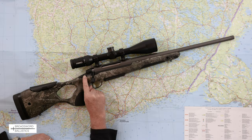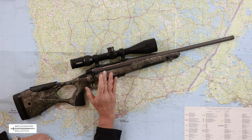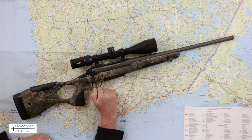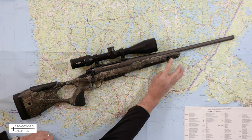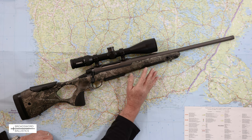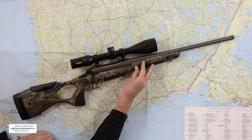It's very popular. It comes from the tactical side, like we say, the Sako TRG. It eliminates a lot of the problems you have with bedding and stock compression on the screws, and it also gives you a very, very lightweight, strong and rigid system for any sporting rifle. It's aluminium, and you can't see here, we'll show you later when I take the rifle apart, but the aluminium chassis starts here on the forend, which it is attached to.